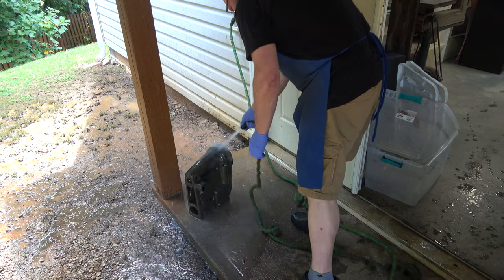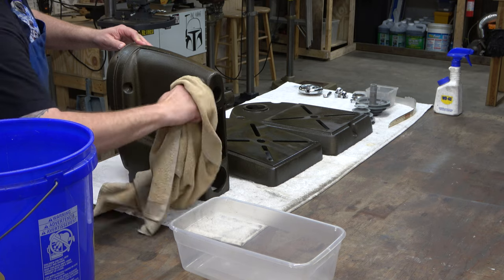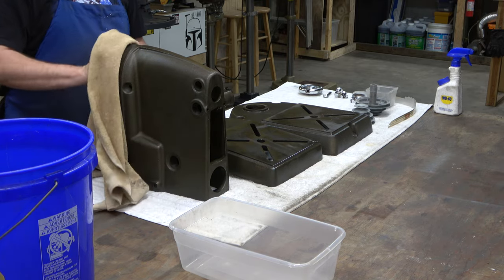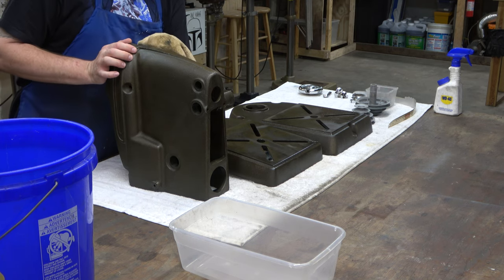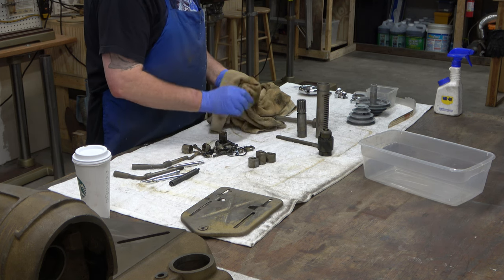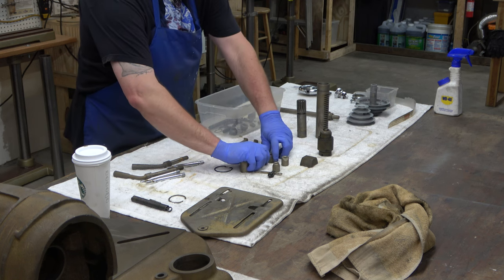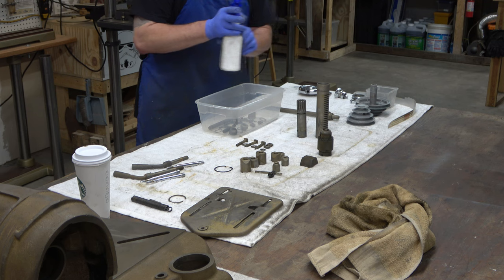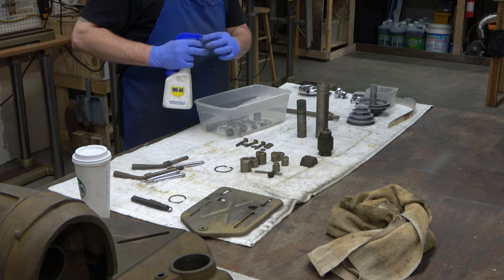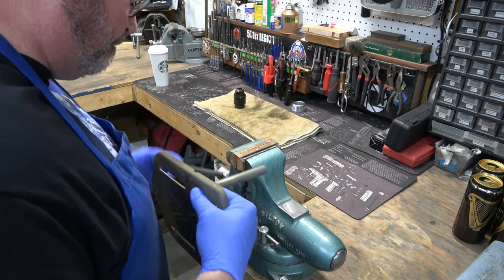Just rinse them all off. The parts that are going to get painted, I want to dry them first to minimize as much rust as I can, so I'm going to towel dry them as best as possible. I wouldn't recommend using compressed air — I think that's going to increase the likelihood that they develop more rust. All the parts that aren't getting painted are just going to go in a plastic bin and get sprayed down with WD-40. The WD-40 is not a long-term solution, it's just to keep them from getting rusted. Most of these parts are going to be hit with a wire wheel or polished in a later video, so we're just kind of putting them in the freezer, if you will, for the time being.